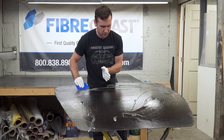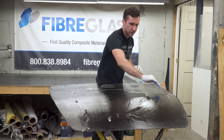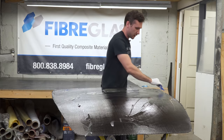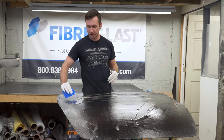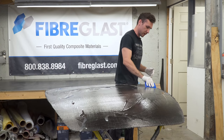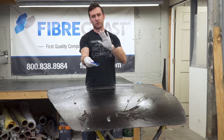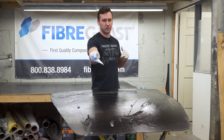We have two layers where the weave is going one direction and two layers going the other direction. You can see the carbon darker line follows that pattern. You could also do a zero-degree orientation, but this part is too long — we'd have to have an intersection of two different layers of carbon, which could create a problem. So for this, just intersecting them is more than enough. It keeps the part really stiff. If they're all going the same direction, it'll want to bend in one direction more than the other.